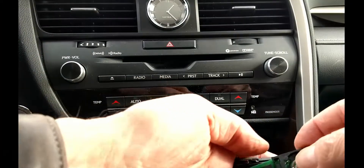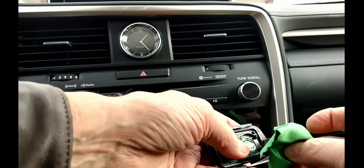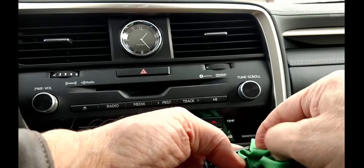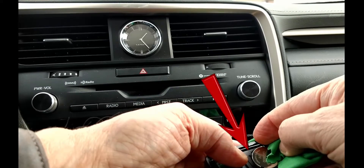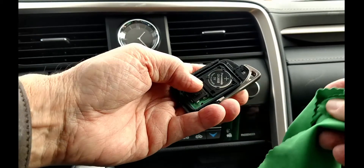Return the circuit board with the battery end towards the key ring end and the battery space facing up. A new battery snaps in easily, starting beneath the two plastic protrusions shown. Make sure the markings are up and push it fully into place.